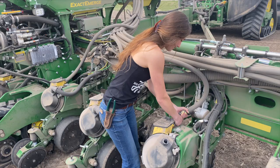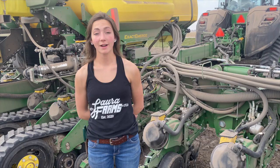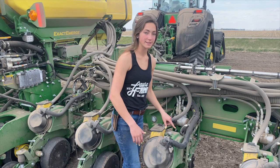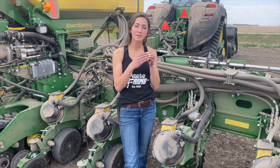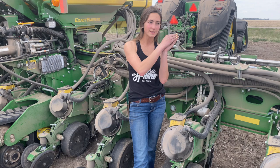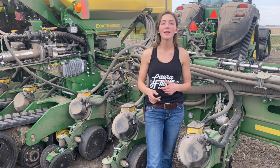Since there's no electricity running from the back of the tractor to the planter, there's a hydraulic line that runs a generator here, and that generator runs electricity to a little motor inside that turns your seed belt. The belt drive is different from a lot of other planters that just have a tube or different sections to carry the seed down. With the belt, the brushes hold the seed all the way around from inside and all the way down, so the seed is held until it's dropped right in the ground. The seed isn't bouncing around, and that helps with the great singulation you're seeing on the cab monitors.